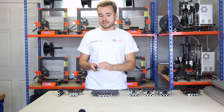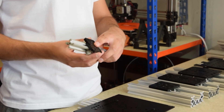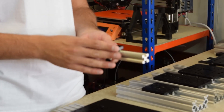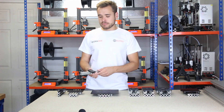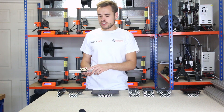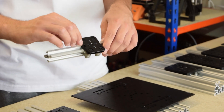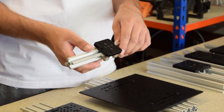This is a 6mm plate and it has threaded holes in the top for M5 bolts, so you can screw a camera or any other apparatus to it. This gantry can only be belt driven — you belt drive it using the slots here. You wrap your belt around the slot, zip tie the belt to itself, do this at each side, and then you've got a belt driven gantry.